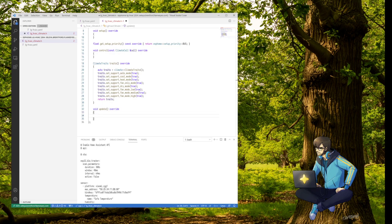What I'm going to start with is very random. I don't want to read the data, I need to find the UART device, right? Need to look at the documentation for this. Oh, that's in there, because those are all the definitions of it. All right. So I'm going to write a byte for now, which is just going to be H. I'm just going to write H everywhere. I don't care for now. I just want to make sure that this even works at 104 bps, and that I can even build it, because I don't know if I can.